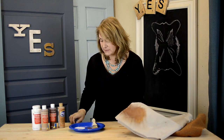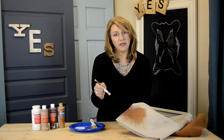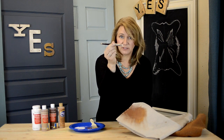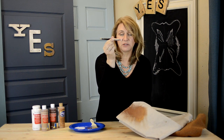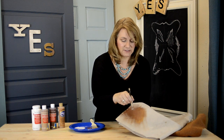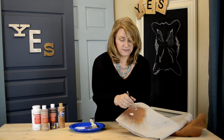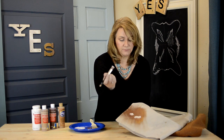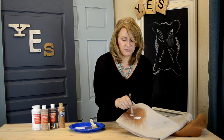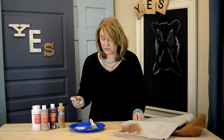You don't need to be dainty or delicate about this. I went back in — I'm going to show you a spot on the edge. You'd use the same kind of brush to do the white, but if you want to do a spot you might want to use a stenciling brush. What defines a stenciling brush is just having a flat blunt end so that all the paint hits the surface at the same time. I'm just putting in a spot — that's it. Don't make it too even, and don't go over it again and again because you'll start picking up the dark brown from underneath and lose the white.